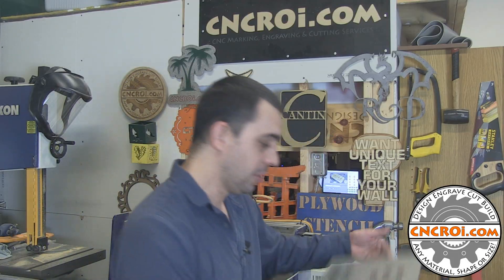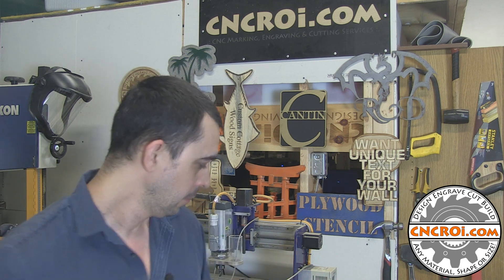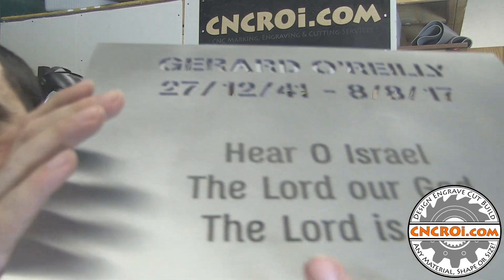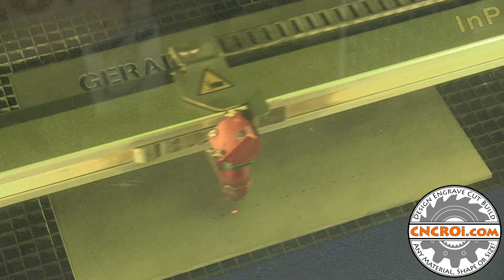Up to this point we still haven't actually etched the plate — we've just been doing preparations for the actual fiber etching. When you run a custom CNC shop, the water jet was the issue this time, but it wasn't really the water jet's fault; it was just a random event. Those random events can sometimes happen at the very end of production too. With the fiber laser, we etched into the stainless steel plate. This is not annealed — it's actually etched — and then we put a special surface coating over it that gives it the annealed look without the drawbacks. The drawback of annealing is that you keep the reflectivity of the stainless steel surface, while with etching you completely lose it.